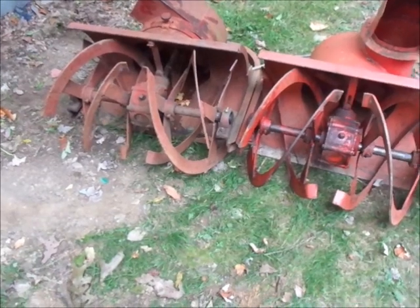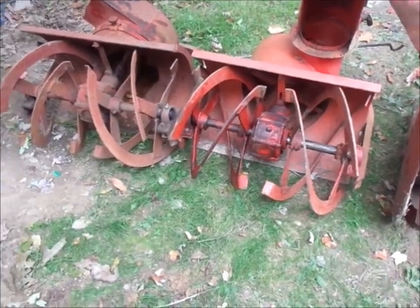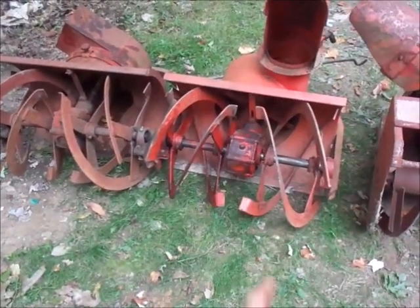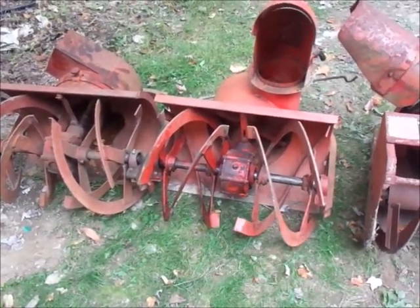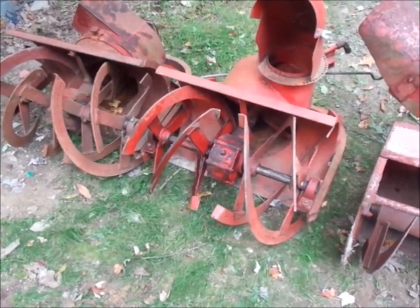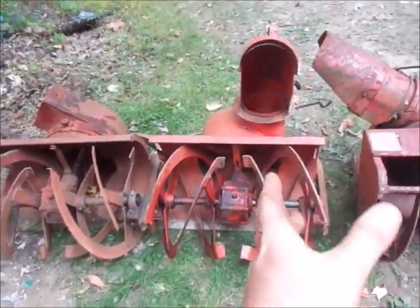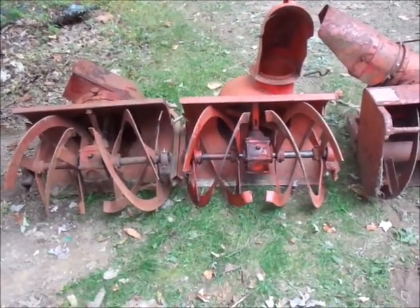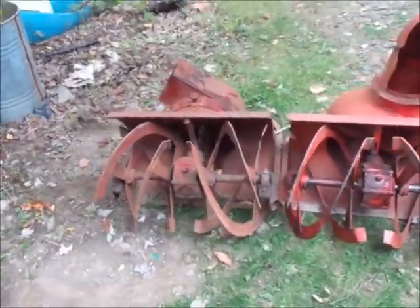Versus the square chute which has a real deep, coarse set of gears - knock on wood I haven't seen one of those gearboxes blow apart yet. But these are pretty common to fail. I have been into this one and replaced the key in it. I've never actually used one of these, but this winter I think it'll go on the 566. The main two differences were the chute setup - which helped a lot with plugging - and slowing down the auger or reel speed so it didn't feed in so much snow.